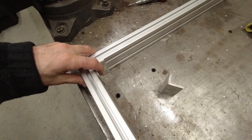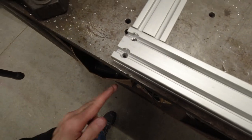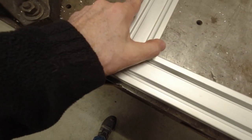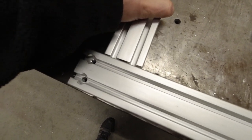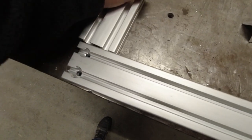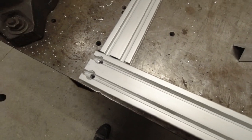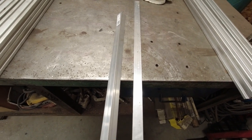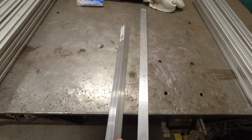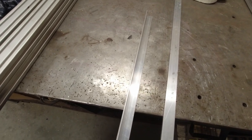I'm also going to drill holes for mounting this way so I can have a piece going down, but the vertical piece needs to be attached too. I can't put a bolt through here because that's where the heads of the other bolts will be. One option is to inset it so I can put both bolts through; another is to bolt one here and add a brace on the outside or inside. I'm going to make a few different parts — some different braces and connecting points. I'll use some flat quarter-inch one-inch-wide bar and some one-by-one-eighth-inch angled aluminum and turn them into connectors.